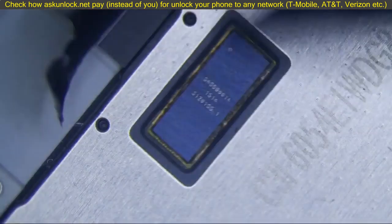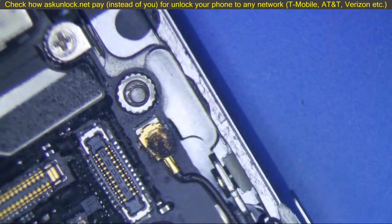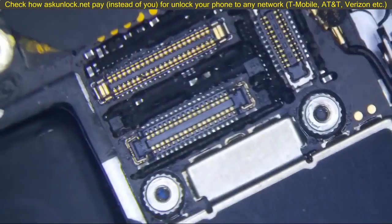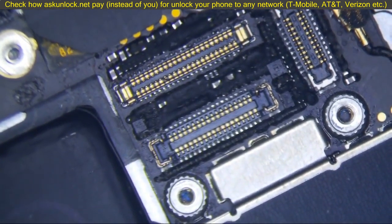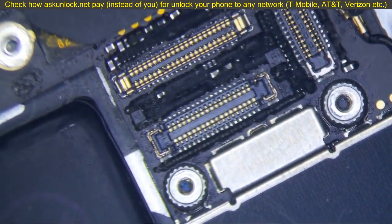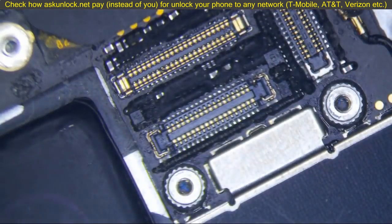This handles the touch. Okay. This requires power. So in order for the screen to work, it has to supply constant power to the screen. So even when the screen is off, we're still getting 4 volts. We're still getting 4 volts to this pin right here. It's actually 3.8 volts. All right. So people think that the screen is off. Okay, I can remove it and put the screen back on.